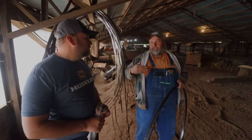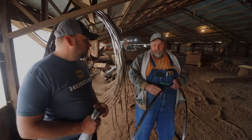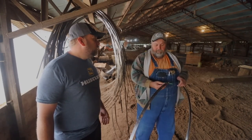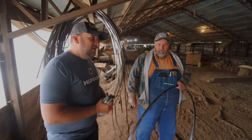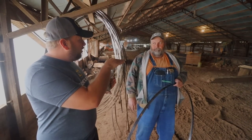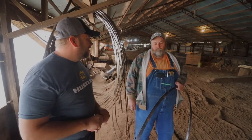Sometimes on sharpened blades, they don't stay sharp as long because all the temper's on the tooth. And as you sharpen it, you're grinding the tooth away. And if you ever get that hot, it'll lose its temper, so it won't stay sharp as long. So 3 hours is not unusual. Mm-hmm. And I only got two, and in the intro I mentioned that I was kind of working my way down into a bowed log, making too many cuts, and I was sawing a bunch of bark only off the top, and that was probably not good for the life of the blade.